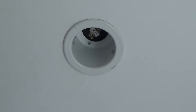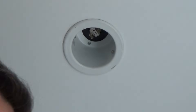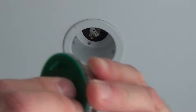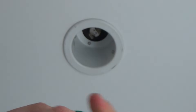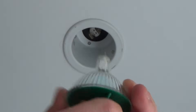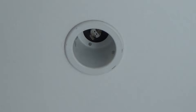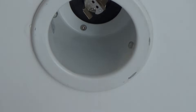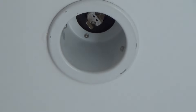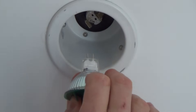This light has actually gone, so I am going to replace this one. I've got my MR16 here — put the sucker onto the end of it. Make sure the wattage is the same and that it is an MR16 with the two prongs. Line up the two prongs into the two little holes in the fitting. It's fiddly but you can see the two little holes where the prongs go into.